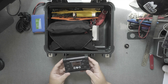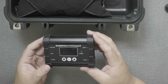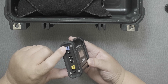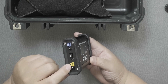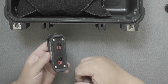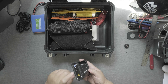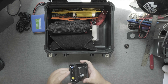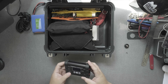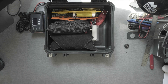With the battery I have the new Buddipole Power Mini 2. This is a solar controller — not only that, it's able to manage my power. You plug in the battery via the blue Anderson Power Pole, then the solar panel, and then the loads. You can have two radios easily connected to this. With the amp upgrade in the Power Mini 2, you can also run a Raspberry Pi with probably no issues. It's invaluable for powering my devices.